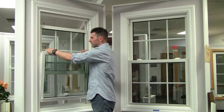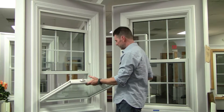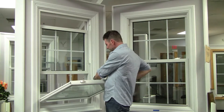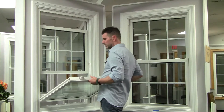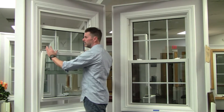Where a lot of clients get into problems is they kind of hot dog it — they tilt the window in, then they start to lower it with one hand. I'm not going to bring it down to 90 degrees because I already know what's going to happen. But if you pull it down to about here and you're only supporting it in one corner, if I'm holding it on the right, this side could flip up and out. And unless you know how to put the sash back in, if it's still in one piece and the glass hasn't broken, you're not going to be able to put it back in. You could go from center, which is fine, but you better make sure it's dead center. Remember there's a lot of sash weight when they get bigger, so you're always better off lowering them from the corners, lifting them from the corners, pushing it shut from the corners.